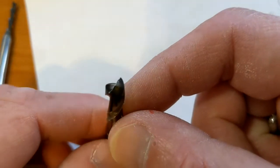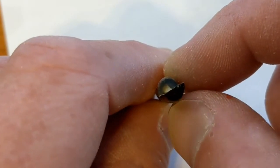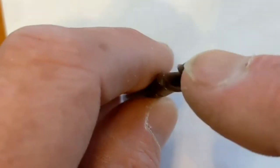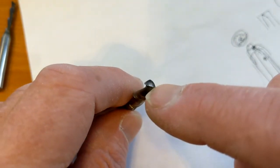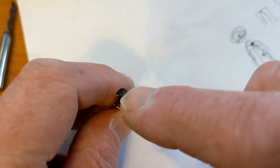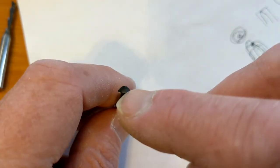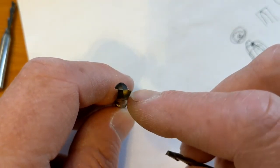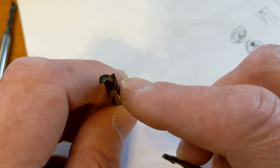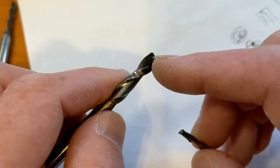The other thing about these is there's essentially a shaft going down the middle. And this little center area right there, when it's plunging into your material, is actually acting like the shaft. It's very dead nut center. That little spot is where material does not want to move away. It'll show up on your wood. You'll see that little circular mark that you've seen in holes before. And that's an area where pressure is being applied against the tool and therefore throwing heat into the tool.